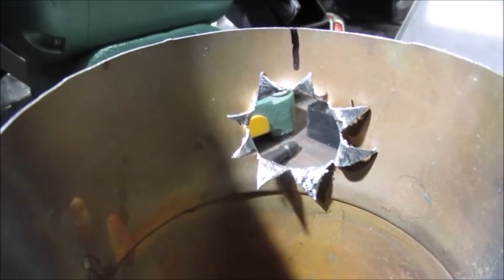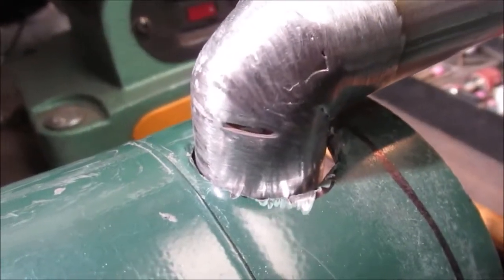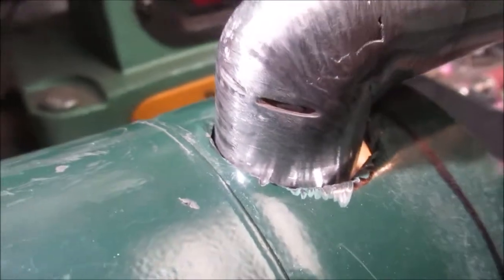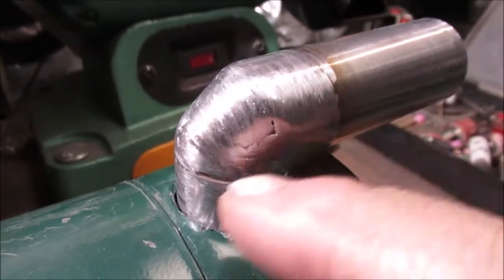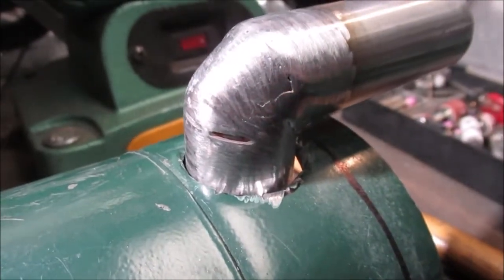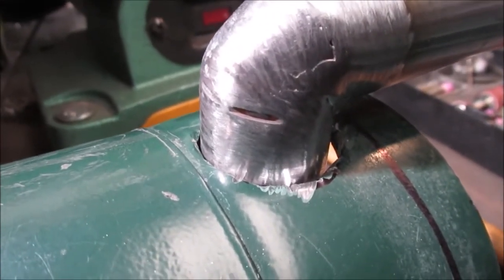We'll pause and shove the pipe in there to show you what kind of gap we have. Okay, see the gap? It's hard in, there's a lot there. So you can bend them back. You could do this to a 55-gallon barrel if you had an elbow that's stronger than the stovepipe elbow, or you could bend them out and put the pipe over and then put some screws in it. So there's 2 ways you could do it.